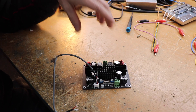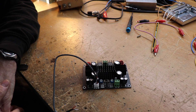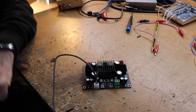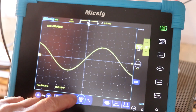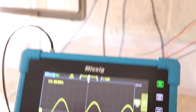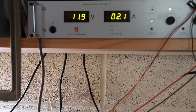What I wanted to do is just see whether this thing would work and has potential to drive one of these Burndeck mod transformers. So we're going to hitch it up to some test equipment and see how it all tests out in terms of frequency response and power output. We've connected this amp up to a signal generator and as you can see from the trace on the scope, we're running at about 200.96 Hz and the sine wave looks pretty good. We've got it at 12 volts and the current demand is about 2.1 amps.